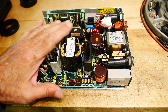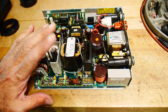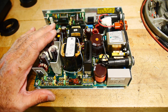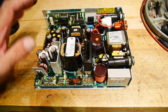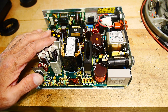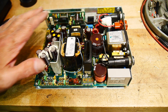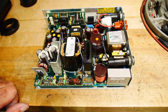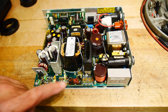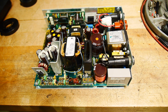This is the actual power supply — assembly A9 out of the unit. This power supply was designed and built by a separate company; it wasn't designed and built by Hewlett-Packard. So if you take a look at the documentation, there is no schematic for this unit, and there is no way to repair it other than knowing what the component was and maybe replacing it. I'm going to try to take some macro photography of this A9 unit to help a subscriber online and see exactly where his problem is, and maybe help him identify some component values.